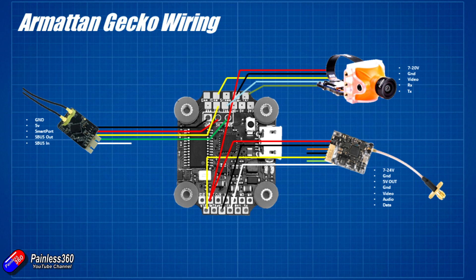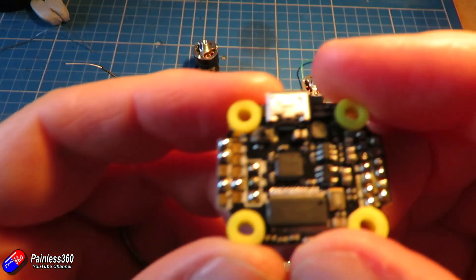The reason for that is that checking with the manufacturer, the 9V supply designed for the camera would have been perfect if I was using another Runcam - something like the Swift or the Eagle - but unfortunately the Split needs a little bit more power than that, so I'm going to run it directly from the mains. I'm going to run the video transmitter from the onboard power distribution and we'll see how we get on with that.